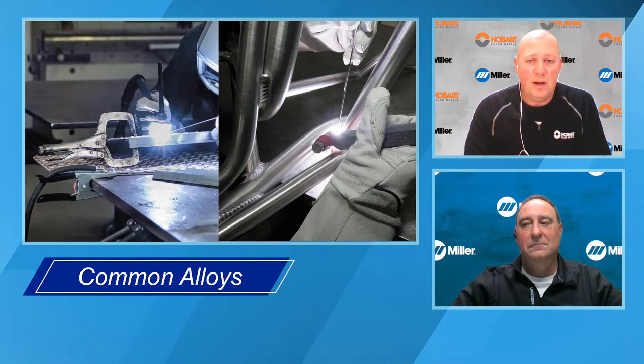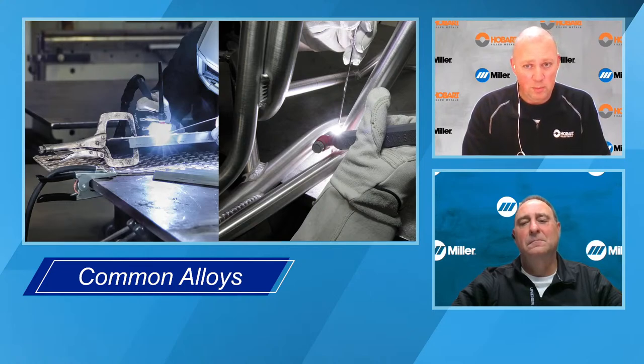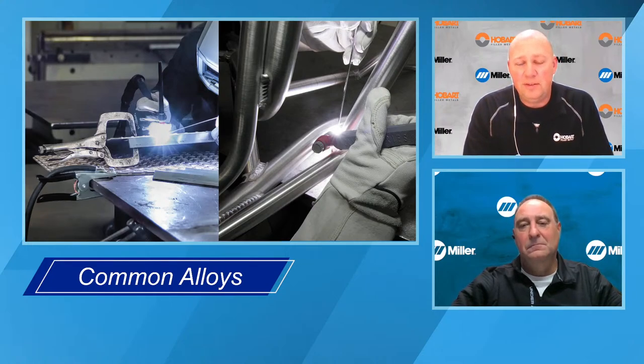If you are able to clean the weld and wire brush it really well, and you spray some Easy-Off oven cleaner on it, sometimes that will make the weld discolor. If it discolors, if it turns more of a dark color, that's an indication that it was welded with a 4000 series filler metal. But again, that's kind of a guess. It's best to contact the manufacturer to find out which alloy it was welded with before you repair it.